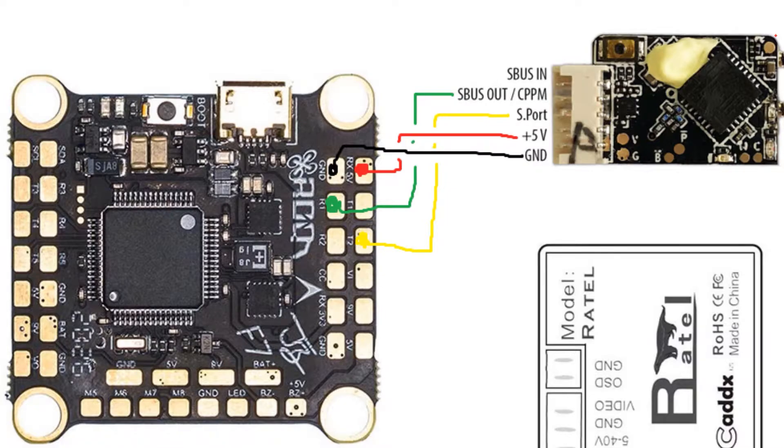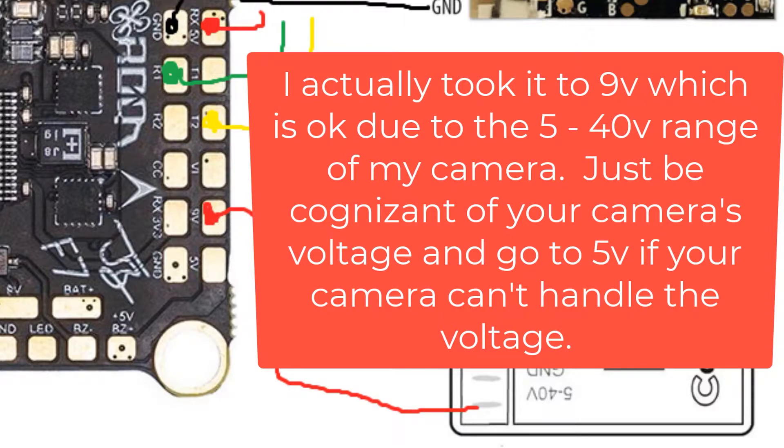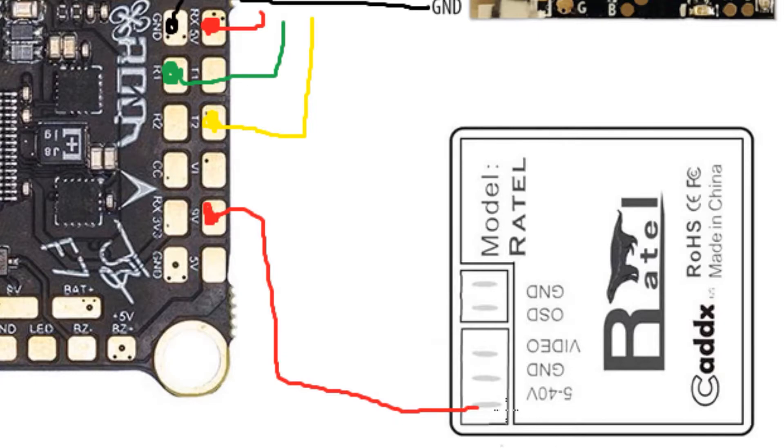Next let's do our camera. There are only three wires we need to worry about here: a red, a black, and a yellow. The red one is going to come off of five volts and go straight to this five-volt pad right here. Next is our ground — we're just going to go right to this ground right here. And because this is our camera supplying the video, that would be video in — we're going to take this video wire and go straight to video in, just like that. Boom — we are two thirds of the way done.